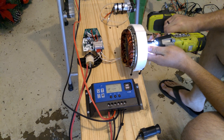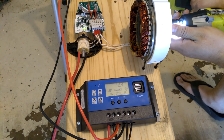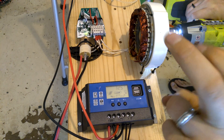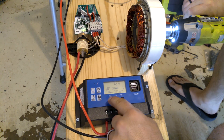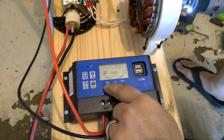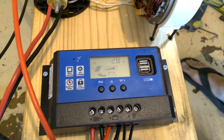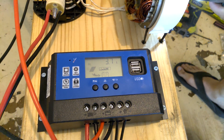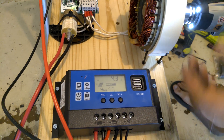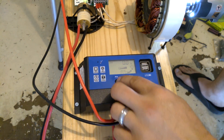The key is to keep it steady. There we go. The green light is on. I'm generating energy from the wind generator, and I'm going to cycle through these menus. This is the temperature. I'm getting 1.8 amps right now. I'm going to increase the speed, and as I increase the speed, it increases the amount of amperage being generated. So that's going into the battery. The battery is going out but it's not really running anything, so there's no drain.